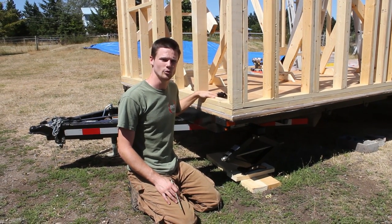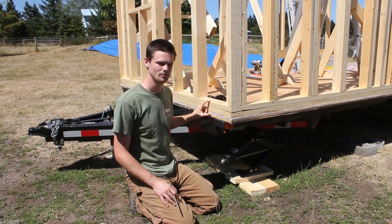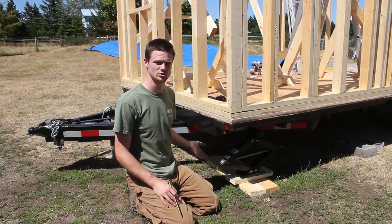To deal with this edge we needed a really long screw — obviously through two bottom plates and the subfloor — and then get a good bite into the framing below.